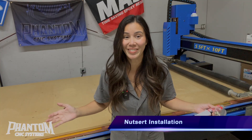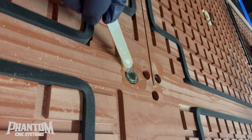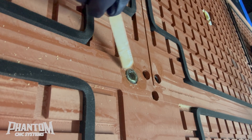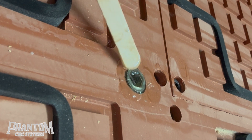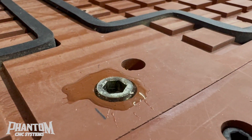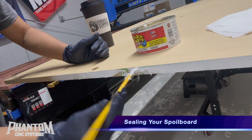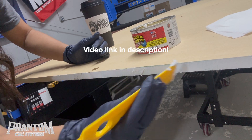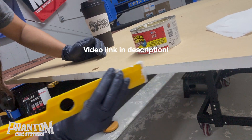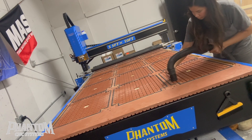The hard part's over. Next, I'm going to remove the MDF from my machine and go around with a little 5-minute epoxy to secure the Nutserts into the bed of my CNC. Don't skimp on that 5-minute epoxy — it's a fine balance of filling that entire cavity and bridging the gap between your Nutsert and your Bakelite surface, while making sure not to fill the Nutsert with resin and keeping it level with the bed of your CNC. While that's curing, I'll do a little more work on the spoil board itself. For more tips on how to prep your MDF for spoil board installation, see Phantom's How to Install a Spoil Board video on YouTube. Before you put the MDF back down for final installation, vacuum the entire surface and free it of any dust and debris.